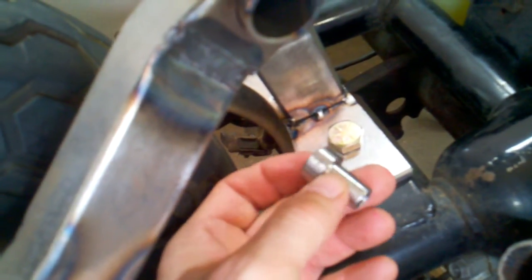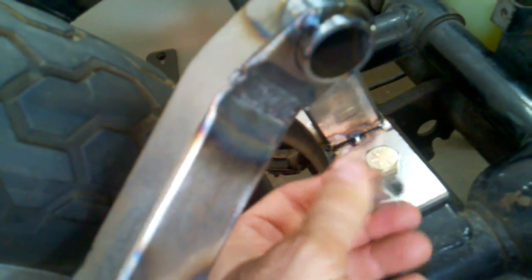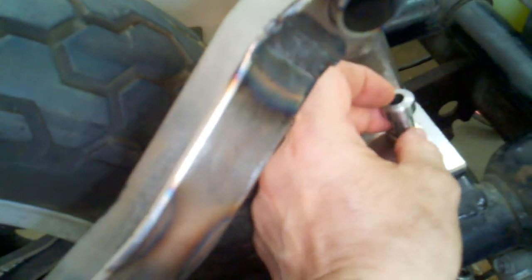I just want to show you how I made my sandwich plate. In the previous video you'll see the sandwich plate that I made. What I did is I had to make a drill bushing after I drilled the hole. I machined it up on the lathe — it's a half-inch hole. I located the holes first, transfer punched them from the plate, made sure everything was centered and square, and then press fit the bushing in to transfer punch on the backside of the lower swing arm housing, just to make an indentation. Then I took a drill that fit pretty tight in there and drilled a pilot hole.